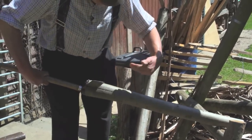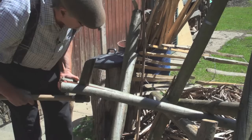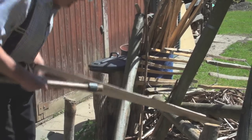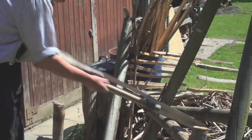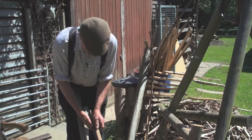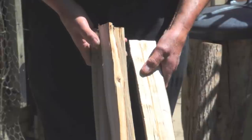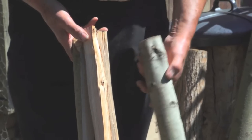The split's wanting to run towards me, so I'm going to turn it over and press down on the fro. That's brought it back to the middle. Both pieces are useful — that's going to make a handle, and we'll get a handle out of that too. When wood is freshly cut it splits so easily — incredibly easy. But now it's dried, life is a little more difficult.